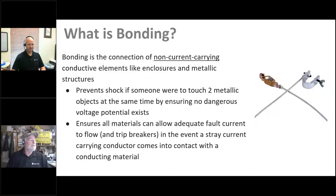Now covering bonding — grounding and bonding are discussed together because they're highly related but serve extremely different purposes. With proper grounding in place, bonding ensures that the metallic components of the system — not so much charge controllers and batteries, but the chassis, metallic conduit surrounding the system — are all connected together to provide an adequate path to ground if they were inadvertently electrified.